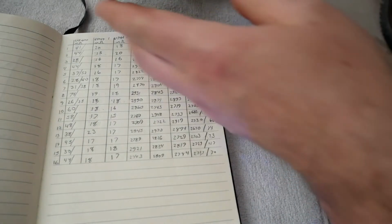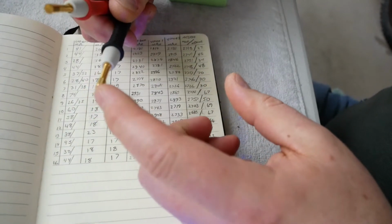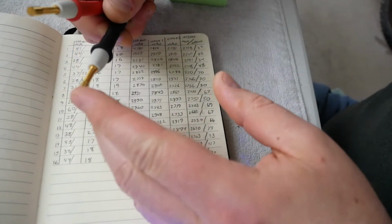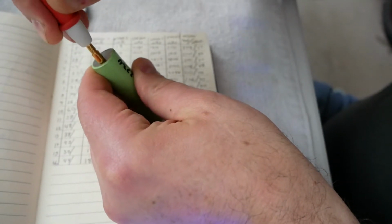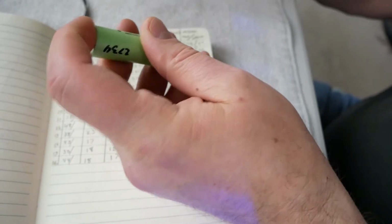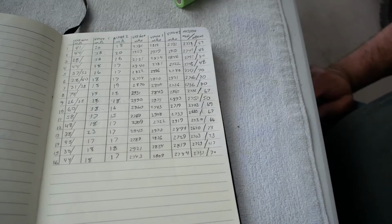However, these are the VP4 Plus test probes, and the ends are a bunch of little sharp points, so it grips my finger. If I kept doing this, I'd be bloody in a minute, because there's lots of those short ends, and I think they just pierce through all that crap that you might possibly build up between them, oxidation or dirt or whatever, and as a result, they do a much better job. And the testing results for IR that I have bear this out.